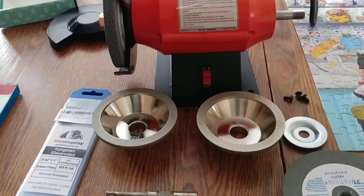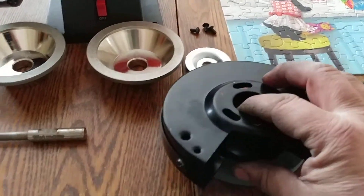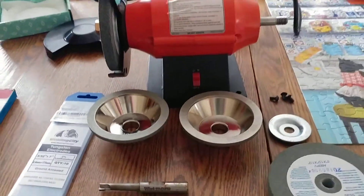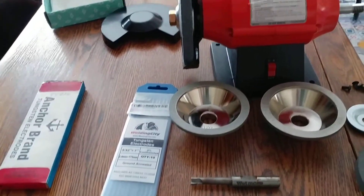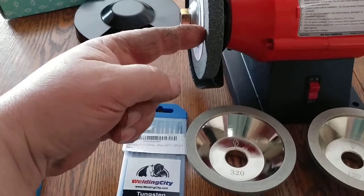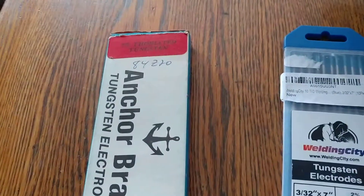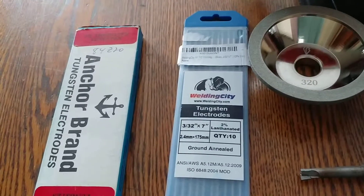I'm going to totally remake this guard. On one side I'm going to make a pedestal with an adjustable rest, and I have to anyway because these diamond wheels stick out a lot further than a regular stone would. The other side I'm going to make basically enclosed. I want this entire thing enclosed, but I'll put a couple of different holes in there at different angles for grinding tungsten sharper or less sharp, and then make a clean-out tray down below, because this stuff is not good to breathe — the dust from tungsten. And this is definitely radioactive, so I have no plans on sucking that dust if I can help it.